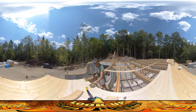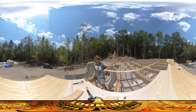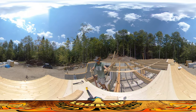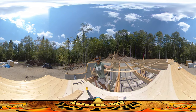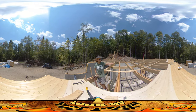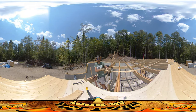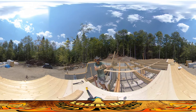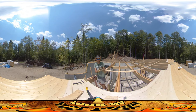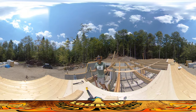You might be able to see there's a little bit of a gap here. I'm intentionally leaving some gaps on this side because the boards on that side were getting a little bit ahead of these boards over here. I need these boards to kind of catch up so that when I get to the other side of the stair hole, it's one continuous run and the boards are in line with each other. Since those boards had fewer gaps, I'm just adding little gaps here and there so I don't end up with like an inch of space at the end.